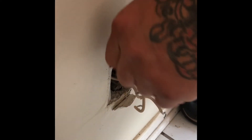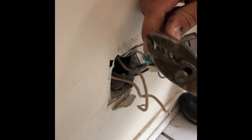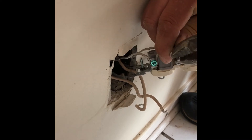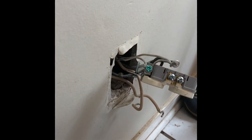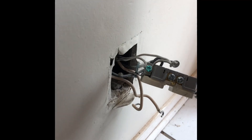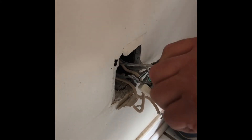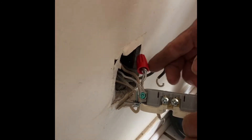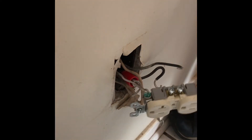I have a pair of lineman's cutters but I don't know where they're at, so I'm doing this. Why should it always be tied together, not just screwed together? Because that'll burn your house down too, just like you've seen in that receptacle. White to silver, black to gold.